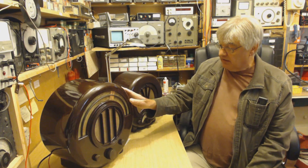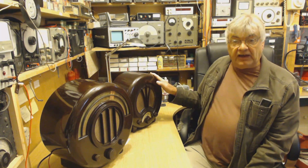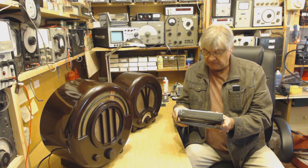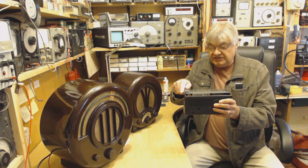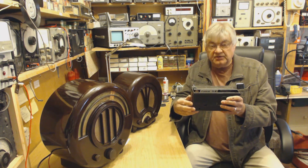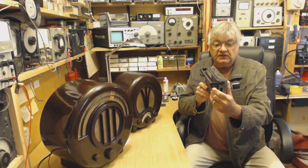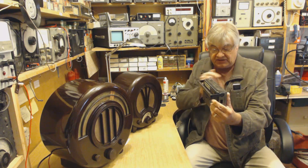Not a fault with the radio. Just as a double check, I already had this one on test — same thing, dreadful interference. I then grabbed my transistor radio. Now as you know, with the ferrite rod aerial which runs that way, you don't get a lot of signal pickup on the ends — it's broadside. So nothing much that way or that way, but lots of interference from that direction or that direction.